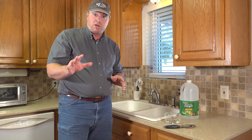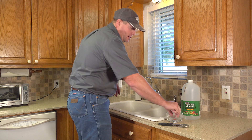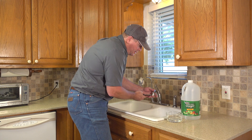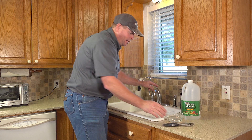Once you've gotten rid of all the chlorine, it's time to go turn on all of your water treatment systems — everything that you turned off: your reverse osmosis under the sink, your water supply to your refrigerator, your water softener, put your cartridges back in your filter, turn everything back on normal. Then take the aerators and reinstall those on all your faucets. Give it a little tighten with pliers — you don't have to be real tight. Make sure that's working normally. The last thing you need to do is run your clothes washer one more time, maybe twice, without any clothes in it. You certainly don't want to ruin your favorite set of clothes.